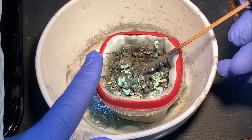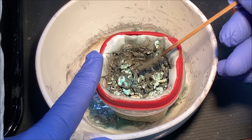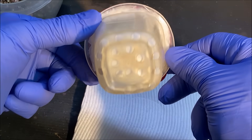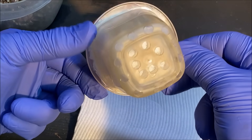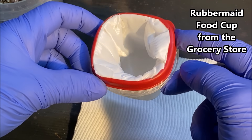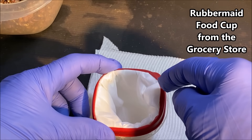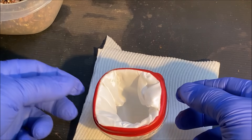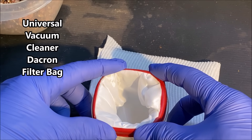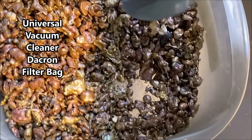The slimes plug the filter up and the current flow slows way down through the silver cell. I've got a brand new anode filter made up — it's just a food cup with some holes punched in it, with a dacron filter bag inside. The lid of the food cup is cut open in the middle so it forms a little retainer ring that holds the anode filter in place inside the cup.